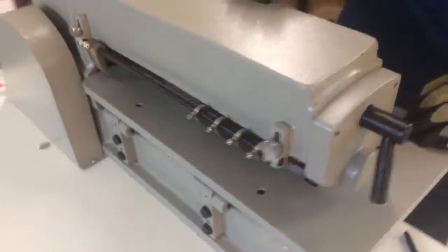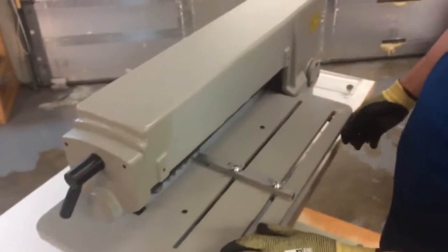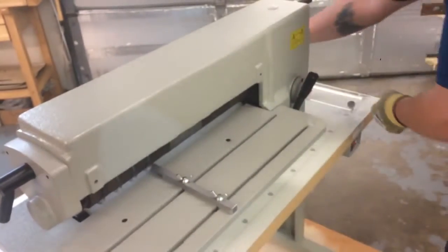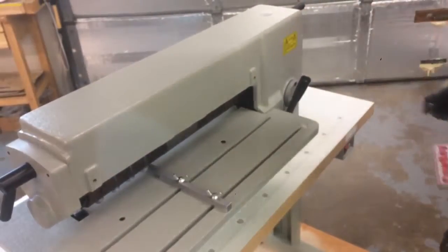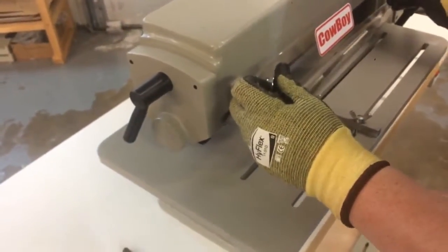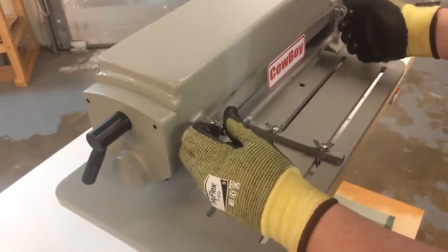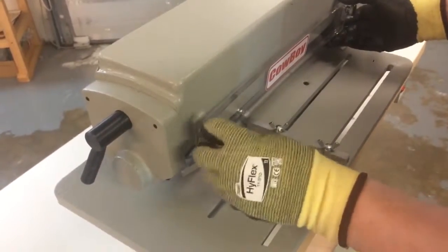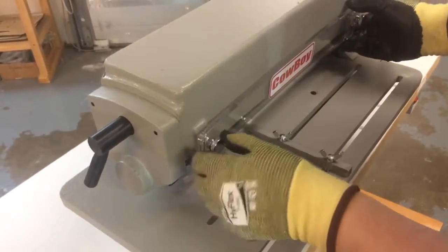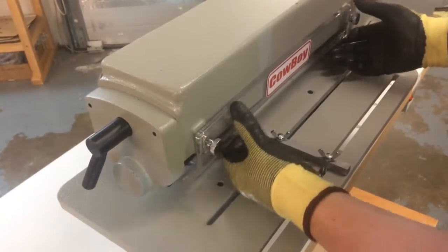You come back around the front, and the last step, one of the last steps, is you'll raise the platform, check to make sure everything's okay. And then finally, you want to put this cover piece back on. This cover piece is important. You do want it on there. It's not just a crazy lawyer safety thing. It keeps your fingers from brushing up against those razors, and heaven forbid that you get your finger caught in there and it goes through the machine. That's not going to be a good day. So it's important to have these in here.